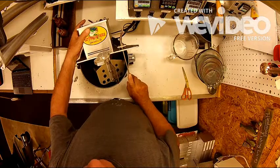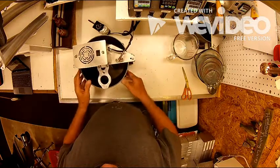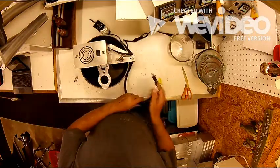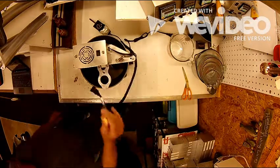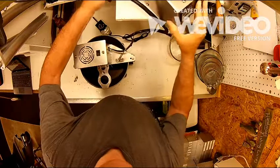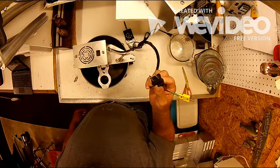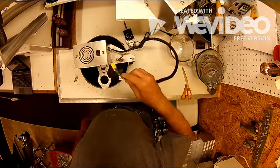If you don't have this unit inside your pot you're not going to be able to control the temperature from an outside source. It's connected to the PID with this cord — it has its own cord when you buy it from Leonard, and it's got a small two-pronged bayonet cord that goes into the back of the PID. The other cord is the 115-volt AC cord for the rheostat control on the Presto pot. Those are the two main things you need to control the pot and the stir.